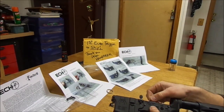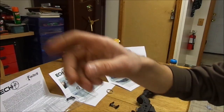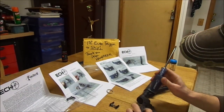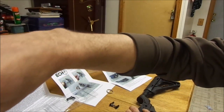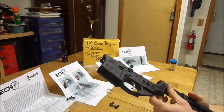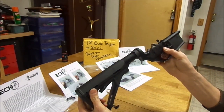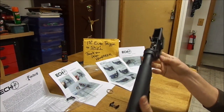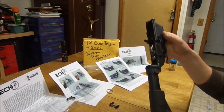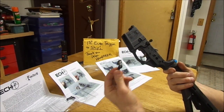I don't have my little mallet at the moment, so I'm going to use a screwdriver to tap it in. There we go — that was relatively simple. Put the pins in place where they belong. Looks like the trigger lock is a little crooked in there — it's not really being retained at this point. The next step will be to install the selector. We'll do that next.